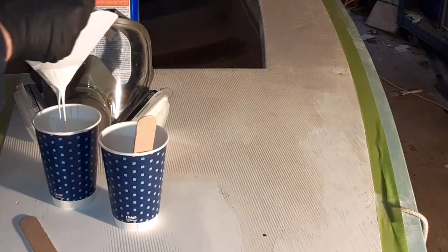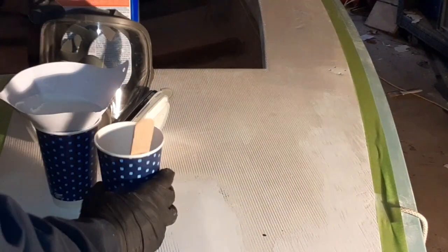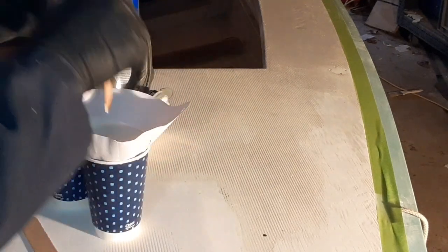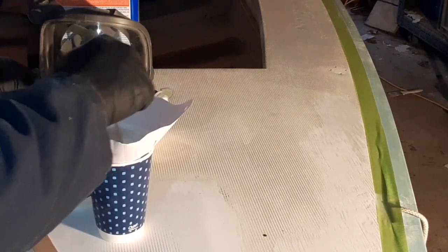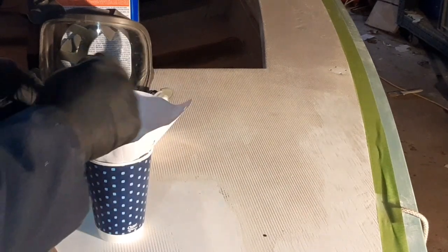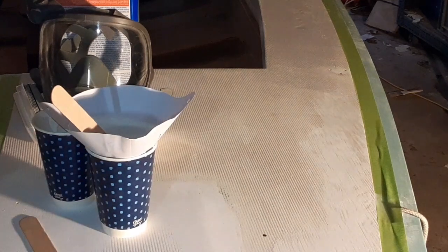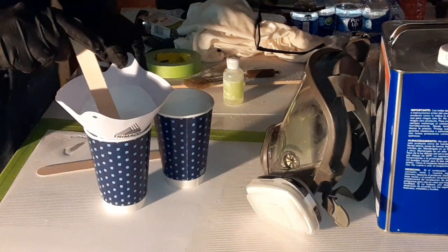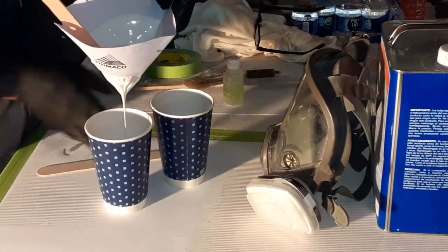This pigment will be used to bring the color up to the off-white that is on top of the vessel. You'll notice the portion the cups are sitting on is very bright white — that's just white gel coat, no pigment was added. The pigment only needs to be added to the very top coat that you put on your repair. So I'm going to dilute the pigment into the white gel coat. This is going to give me a darker gel coat cover than I actually desire, but that tinted gel coat will be used in the process of bringing a cup of filtered white gel coat up to shade.